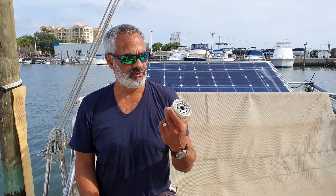We're lucky this engine is basically self-bleeding, so once we have them all changed, we'll be able to turn the key. The fuel pump will pump fuel through, bleed itself, and then it'll start. A lot of engines you have to bleed manually, but this is the fuel filter changing part, so we're going to change fuel filters today.